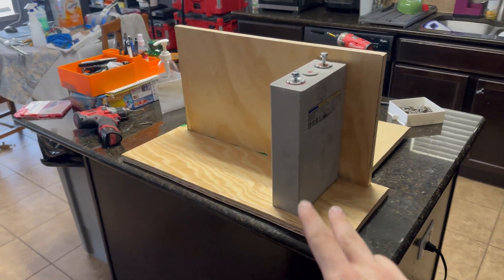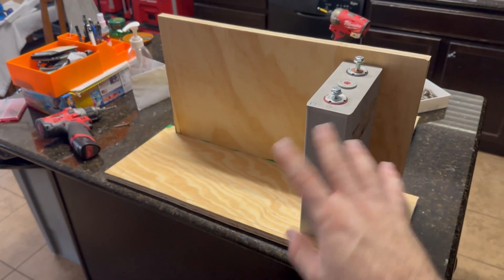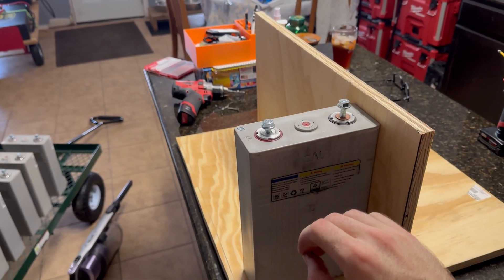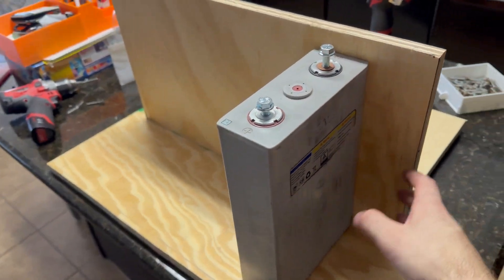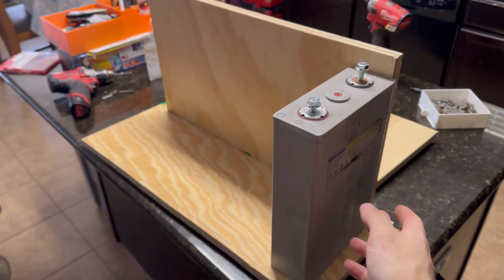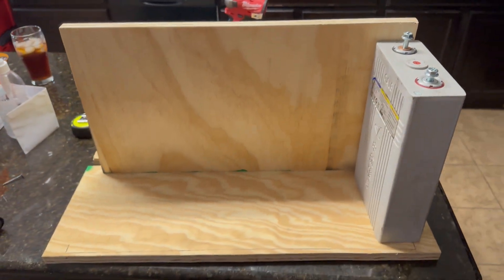So I'm actually going to do two different boxes — two boxes of eight, and then put those next to each other. That way I have a little bit of space between the cells. It's easier to work on and diagnose any potential issues. I'm building a little bit of a lip on here as well, so I can put a cover on this once it's all done. I'd like to do plexiglass so you can see all the wires and stuff. Also, when I cut these, I left it so the cell is going to stick out a little bit, and that's where I'm going to put my plates to add a little bit of compression using all-thread rod — just the slightest amount of compression on all the cells to keep everything happy. I don't want anything bloating.